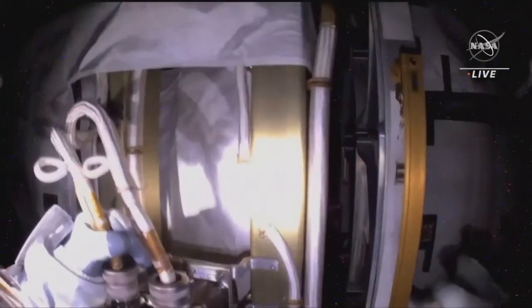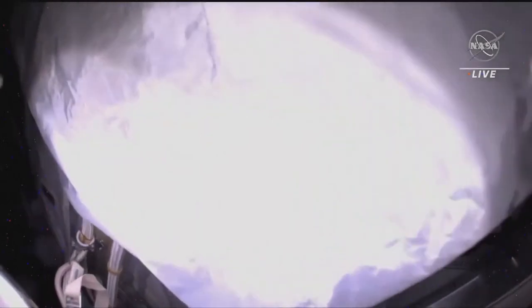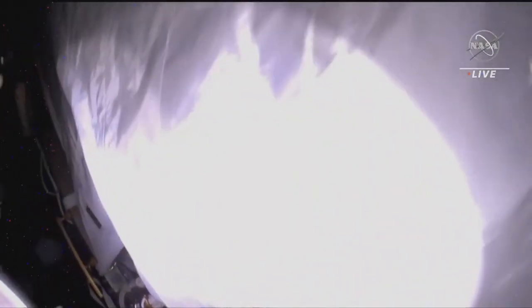into the mod kit. That's translation on folding IROSA, bolt ops, connector ops, or cable routing. Sudden stops and quick grabs are not allowed on the mod kit. 30 pounds max lateral load on mod kit during and after IROSA soft capture.